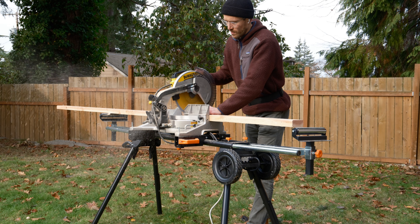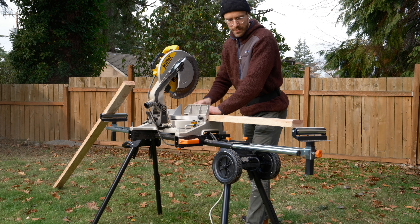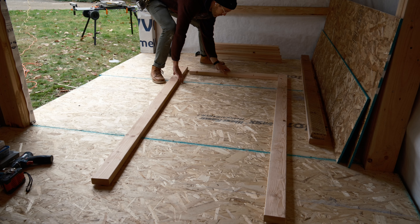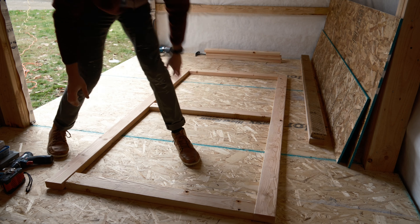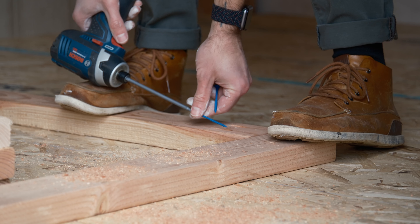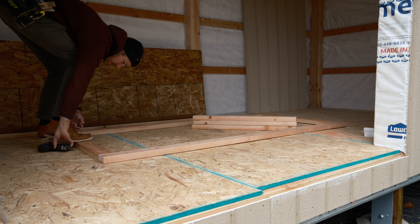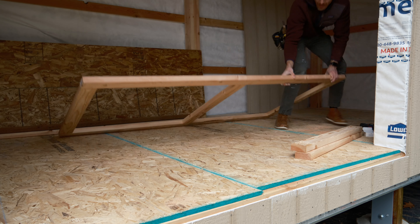With the trim drying, I figured it was a good time to get started on some doors. This door frame design is pretty simple, just some flat 2x4s attached with pocket holes, but I must say this did not yield the flattest doors. So if I had to do this again, I would probably turn the 2x4s on end so the doors were a bit deeper, and I think that would have given me doors with less twist in them at the end.